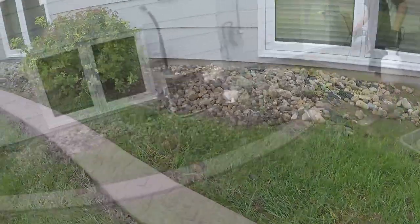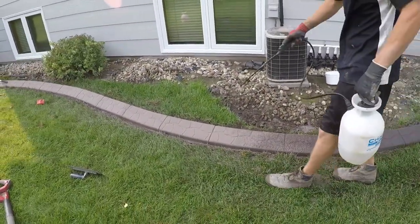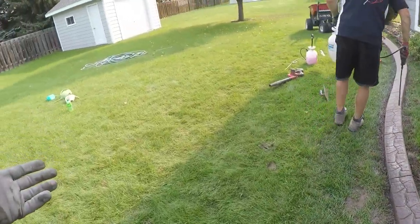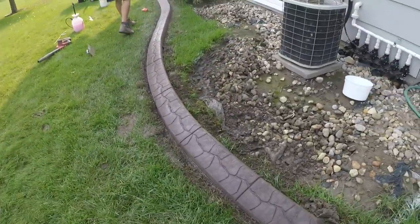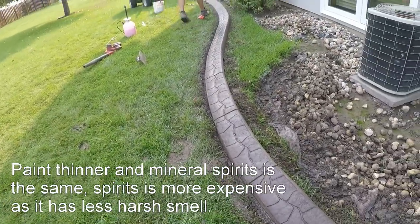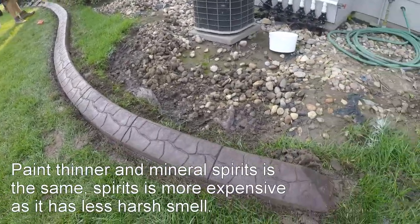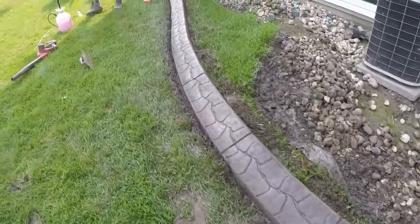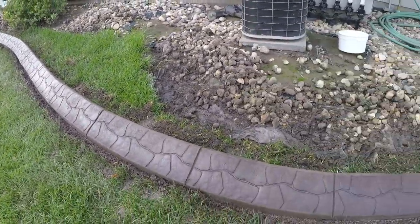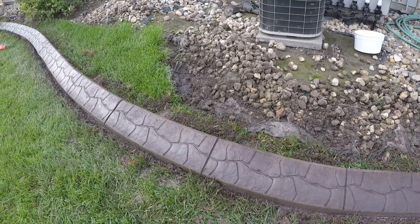Before, when I used to broadcast and throw it on, we'd have a lot of powder left and a lot of dust in the air. With this method you use a lot less. I'll go ahead and cut this like normal. What Chance is doing here is taking some mineral spirits or a paint thinner — any type of light solvent — and going ahead and burning that. All you're doing is just getting the curb wet, turning that powder into a liquid. When that dries, it's ready for sealer.